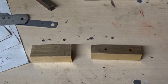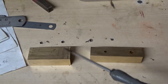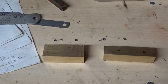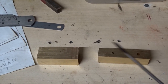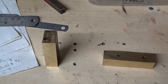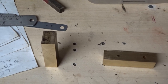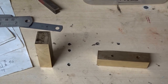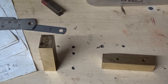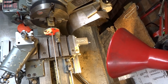I've prepared two pieces of brass. This piece will form the standard for the twin cylinders of the oscillating engine, and this piece of brass will actually be the basis of the two cylinders — we cut it in half ultimately. Each cylinder will be approximately an inch long, and the bore of the cylinders will be 11/32nds of an inch. It's an odd dimension, but the reality is I seem to have a bag full of 11/32nds O-rings, so I intend to use a couple of them. Anywhere between 5/16ths and 3/8ths will be perfectly adequate for what this little engine has to do.